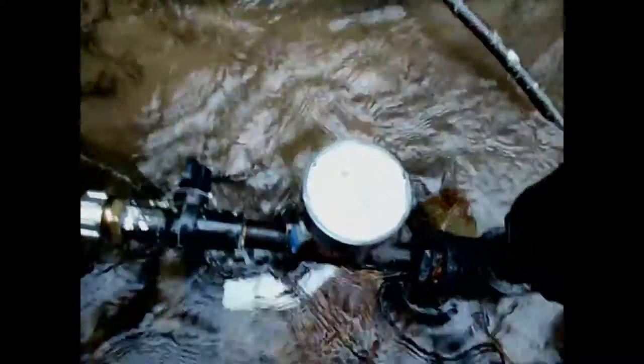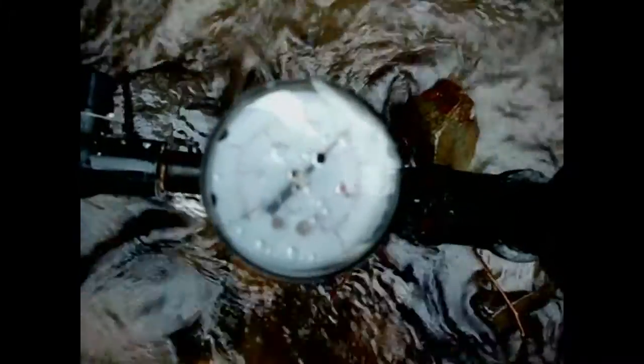We've got it going here. It's already bumped up to almost 30 pounds — and it hasn't even been running 30 seconds. Now that we've got some pressure up, we need to let some of the water go through and start to fill the line up. You can see it's getting good three to five pound jumps. That's good — we're getting good pressure, good pumping.